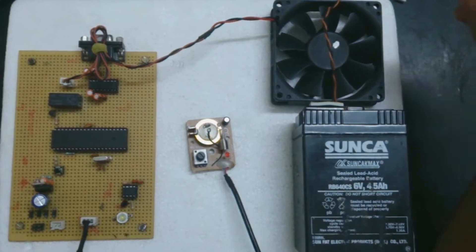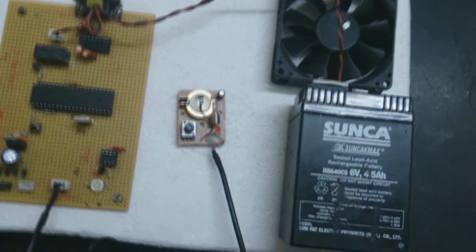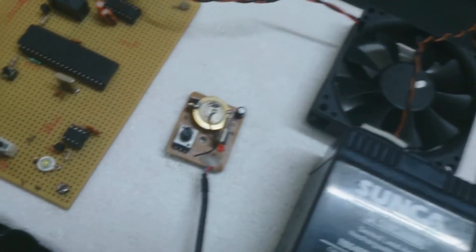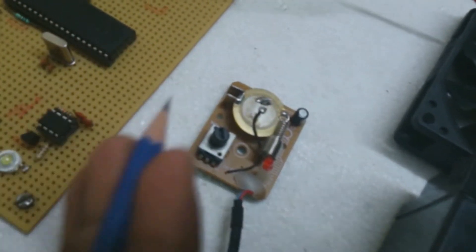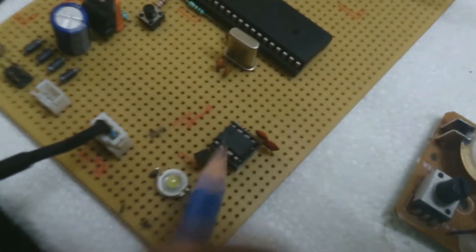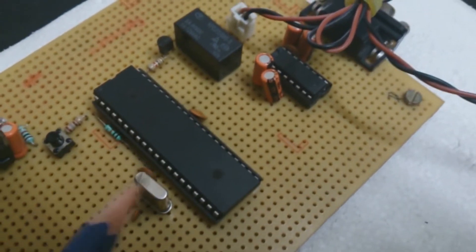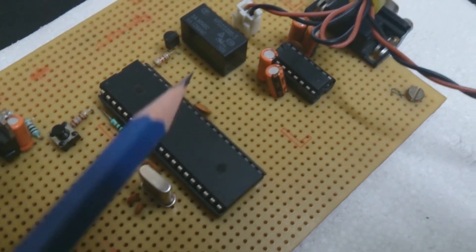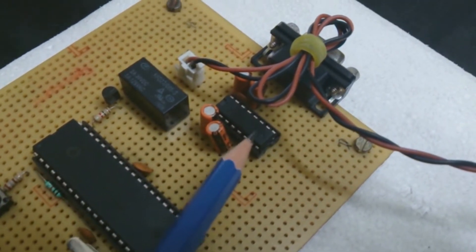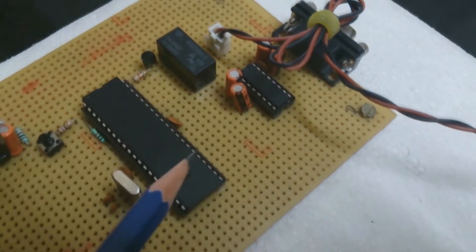Here is the main circuit, from which this is the sensor module. This takes the vibration sensors from the shoe and transmits to the main circuit. The main circuit consists of an LM555 IC timer made by TI and a PIC16F877A made by Microchip. We also see the MAX232 IC which is used for serial communications between the computer and the microcontroller.